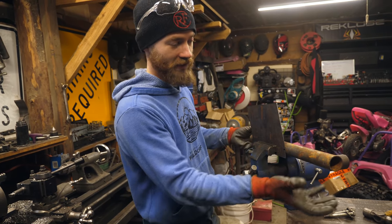This is what you'll be winning — except a brand new shiny one that hasn't been used a thousand times. This is our Rogue Fab bender. We've been using it since day one. It's an awesome bender, does all sorts of cool stuff, very easy to work with. All the die changes are super simple, quick and easy. Just very versatile, very durable. This thing can bend up to two-inch solid steel on the super heavy-duty version. It can do a full 180-degree bend in just two passes — bend it 90 degrees, reset the pin, bend it the other 90 degrees. You can run it with your air compressor — it's air hydraulic — or hand pump it.